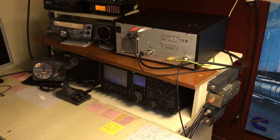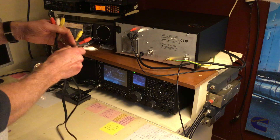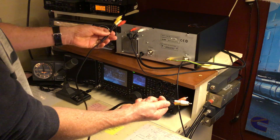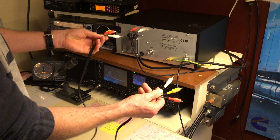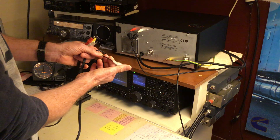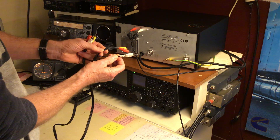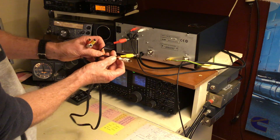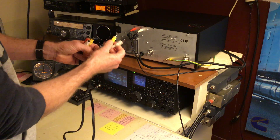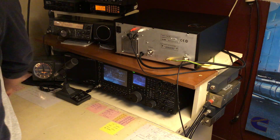A lot of people buy these key-in cables. I don't see a need to — I just make my own. I'll show you how. You should have one at home: an old VCR or DVD player, even a brand new television usually comes with these. So they're free. I had about 4 or 5 of them. What you do is just get a normal pair of wire strippers, which will take that plastic off and you'll be left with a braid. This is like a very fine coax, works perfect. Just choose which colour you want — red active, yellow standby, whatever.